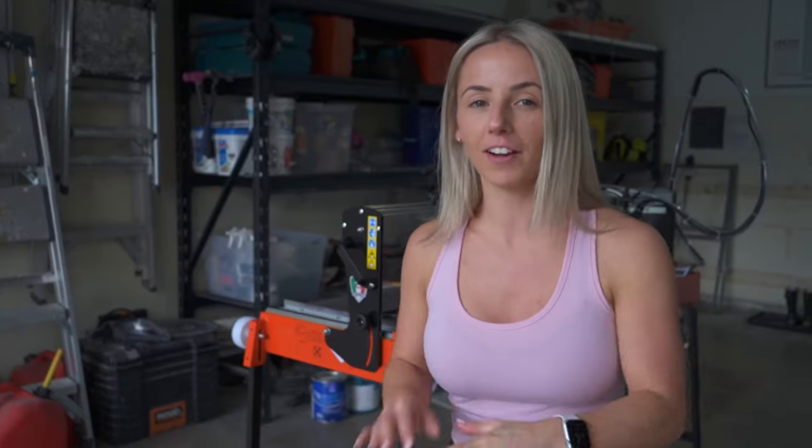Okay guys, so I forgot to film an outro for the Ditra video while we were working, so this is my outro. So now once the Ditra is all laid, the only next steps would be to tile, or if you were waterproofing the entire floor, then you want to band your seams. But since we weren't doing that, you can go right into tiling the same day with Schluter Ditra. So I'll just quickly run you through the steps again.